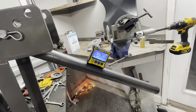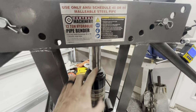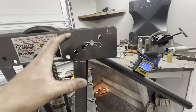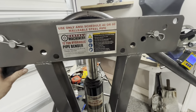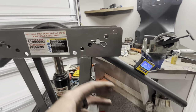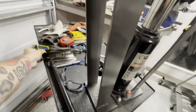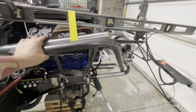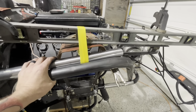I'm going to mark the center of the die right there with a new sharpie, so if I have to put it back in I have a reference to find center at the exact same point left to right. This time I'm going to jump from 25 degrees on the leg to 36 degrees on the leg, which should put me about 70 degrees total - remembering we fall back a little over a degree when we release pressure. Let's see what the spring back is. I'm predicting it's going to fall back to 35. There it is - 35. So that's a roughly 70-degree bend.